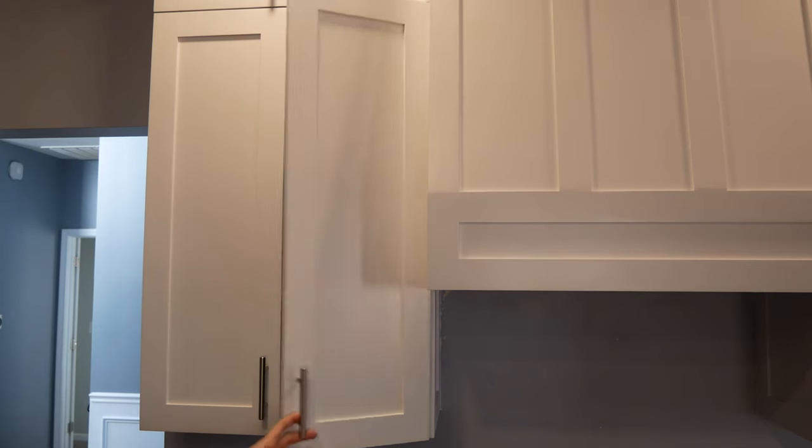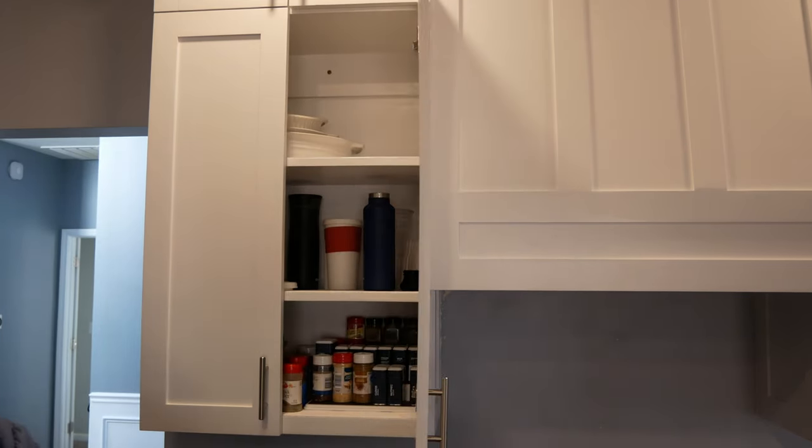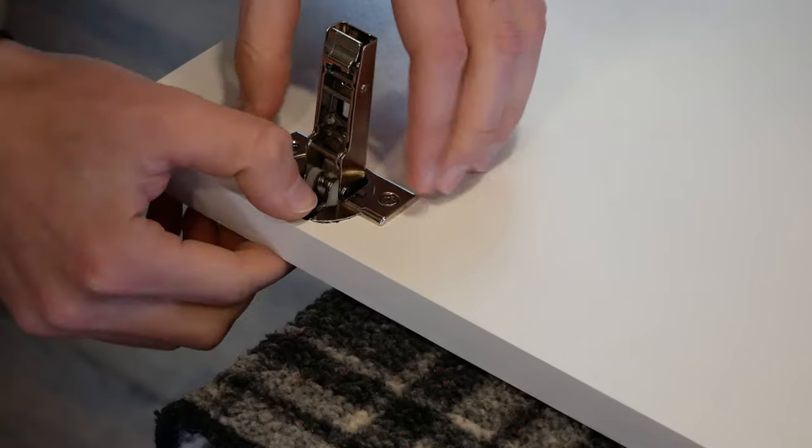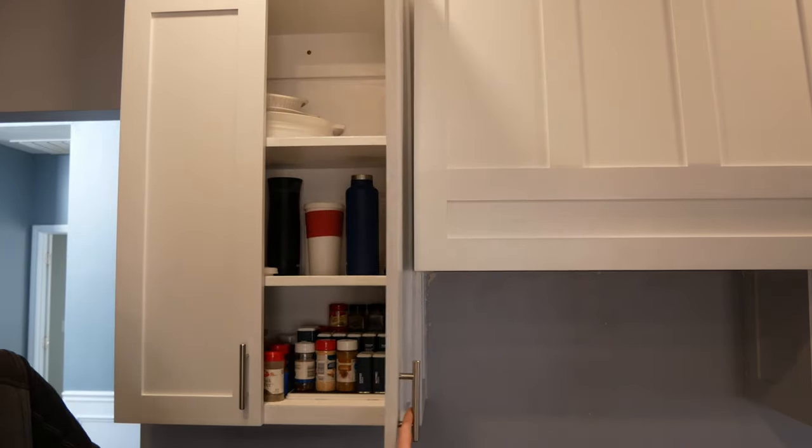Lastly I added a coat of paint to the crown molding, first painting the caulk lines with a brush and then the flat faces with a foam roller. One last thing I wanted to mention: the cabinet doors can hit the range hood if opened fully, so to prevent that I added an angle restriction clip to each hinge — these clips keep the doors from opening past 90 degrees and now they don't hit the range hood. And we're done making the range hood cabinet! If you enjoyed the video be sure to like, comment, and consider subscribing, and check out the free plans link in the video description. Until next time, go build yourself a range hood!